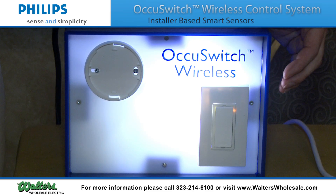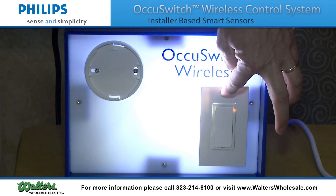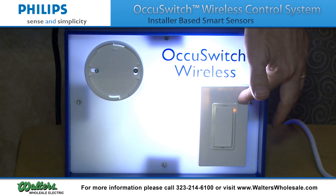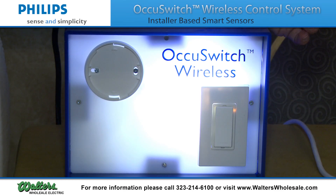To link the devices together it's very simple, just as you would with many Bluetooth devices. At the top of the switch there's a slot, and behind the slot is a button. Use a small screwdriver, push the button in, and the amber LED will become a green LED and start blinking, indicating the sensor is in linking mode. You would then go to all the switches and sensors, press the corresponding linking button, and come back to the first switch, press it one more time, and it takes it out of linking mode — everything is now linked together.